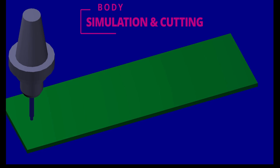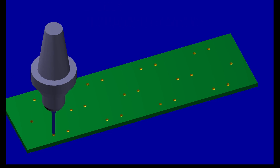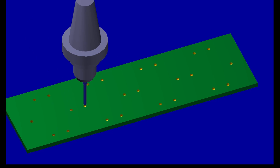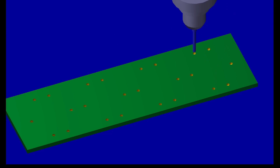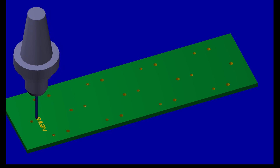The machining is planned to have all the holes center drilled first. The 0.159 holes are then completed, followed by the 0.201 clearance holes. Next, all the engraving is completed by utilizing a 30 thousandths ball end mill.